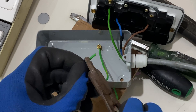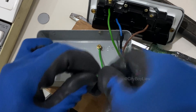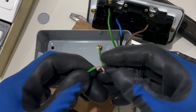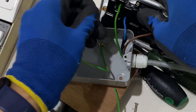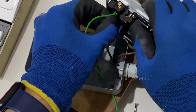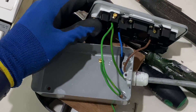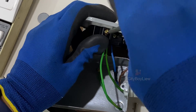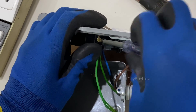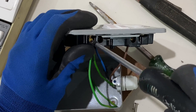This extra wire — make sure the length is long enough. Cut it to the correct length, then remove the insulation roughly 2 cm, fold into half, and connect into the earth terminal. Use a test pen to make sure no copper wire is coming out, then hold it tight. Use a screwdriver to tighten it, but not so tight that it breaks the wire — otherwise it's useless.